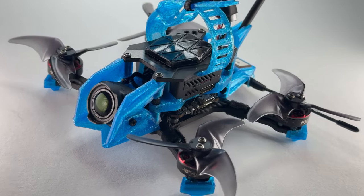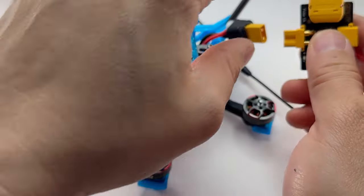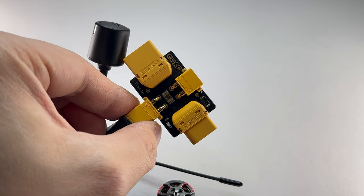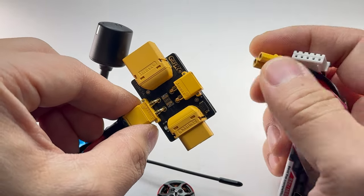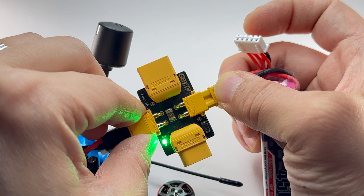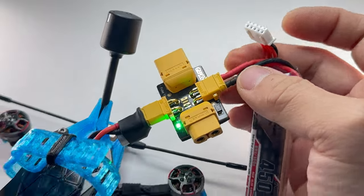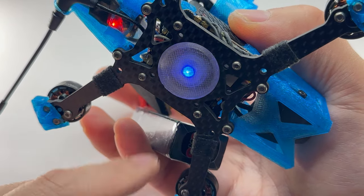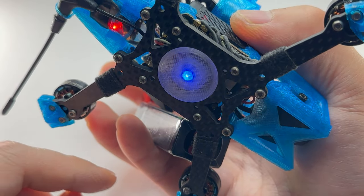The build is pretty much complete — now we're going to check if it has any magic smoke. I like to use this GEPRC smoke stopper. What I usually do is look for the LED light; if it's not on, something is wrong and you should unplug right away. I don't like to plug the LiPo all the way in at first. I got a solid green light, so I'm good to plug it fully in. You can see the LED light underneath turning on — I have it on Larson mode, and I made it blue to match the TPU prints. Just change the setting in Betaflight and have fun with it.